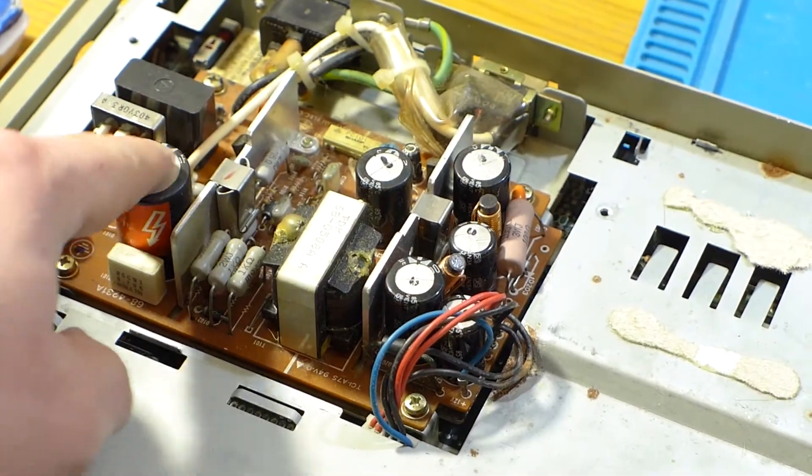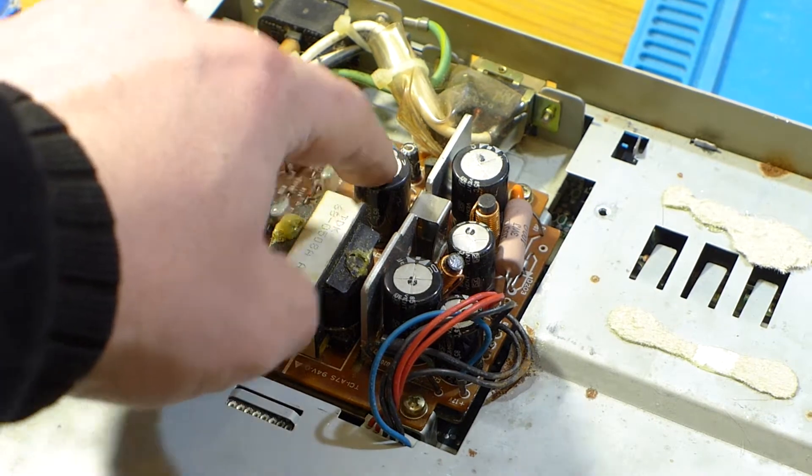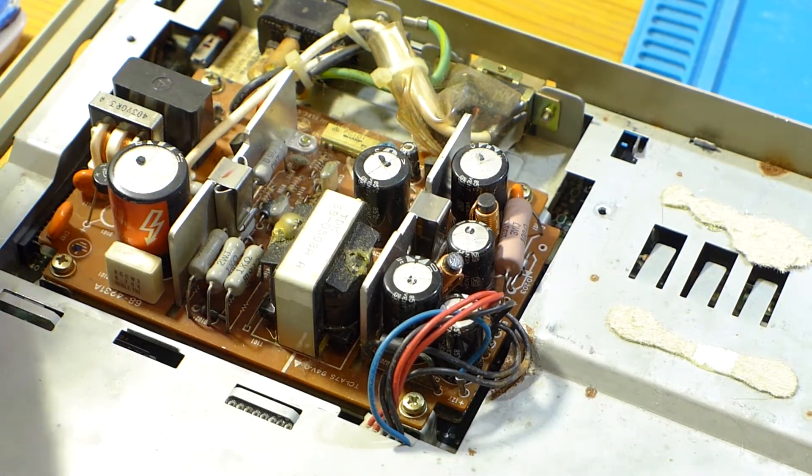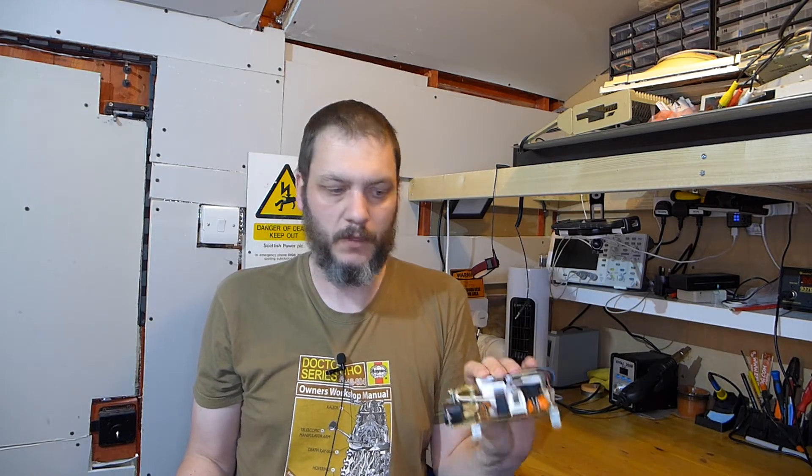It's kind of old, it's a bit crusty, some of the caps on it look a little bit suspicious. I'm not sure if it's giving out the right voltages, so we need to check that this works properly. This is quite important because anything else I want to do with my Atari — if the power supply doesn't give out a decent stable 5 volts, I can't do anything else with it, it might start crashing and acting weird. So let's get on with looking at this thing.